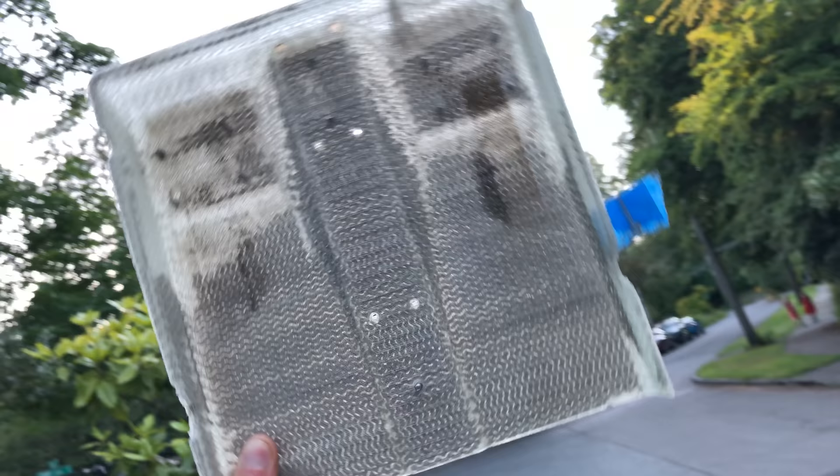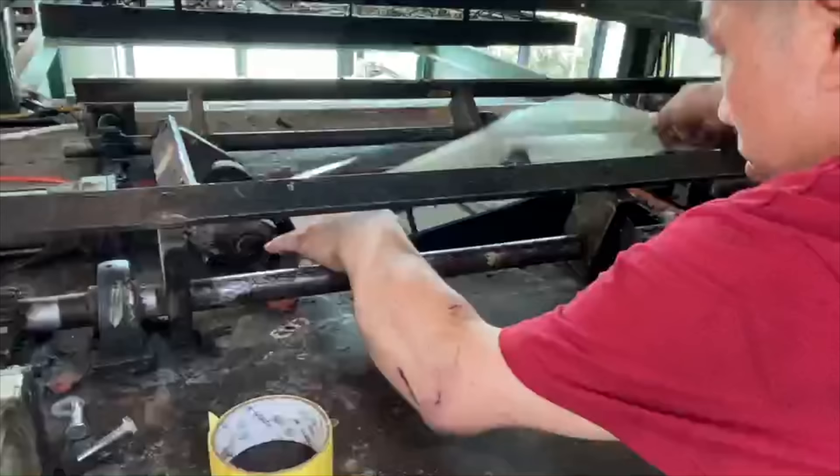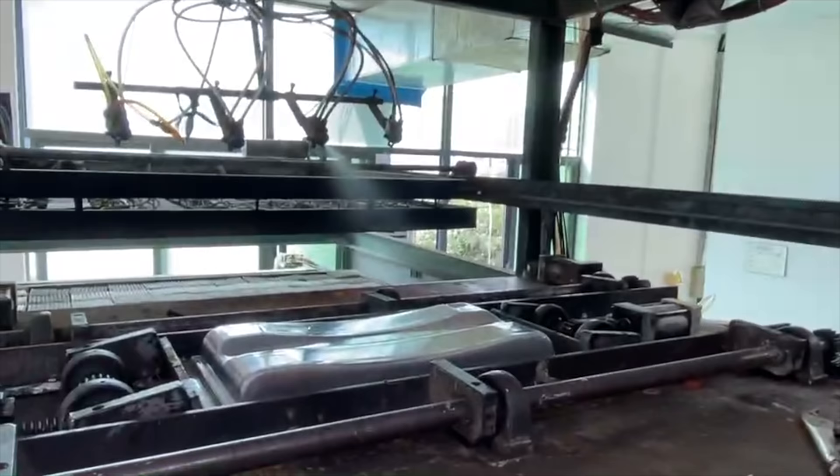That problem ends here. I got these new vacuum-formed polycarbonate chassis halves to test out. These are the first prototypes. With some of the extra Kickstarter money I bought a mold for these. Vacuum forming works by heating up a piece of plastic, putting the mold up into it, and drawing the plastic down over the mold with a vacuum. Then the mold is removed, the part is taken off the machine, the edge is trimmed off, and a bunch of holes are drilled in it with a 4-axis CNC machine.